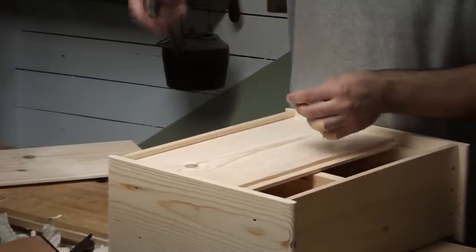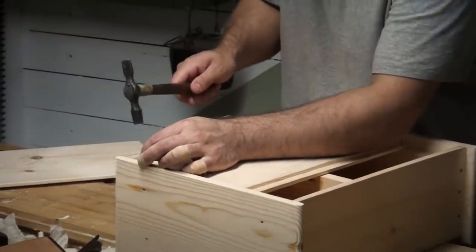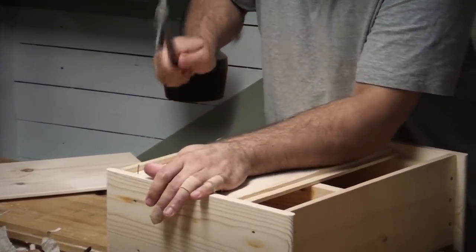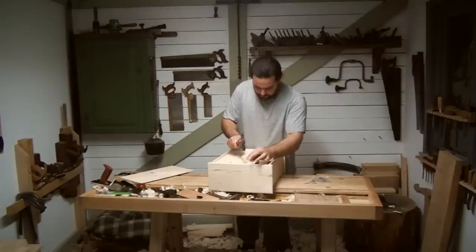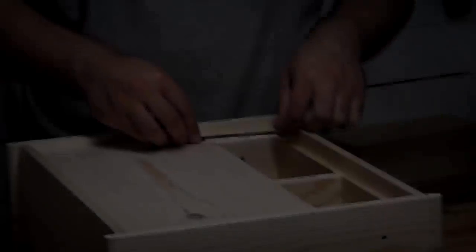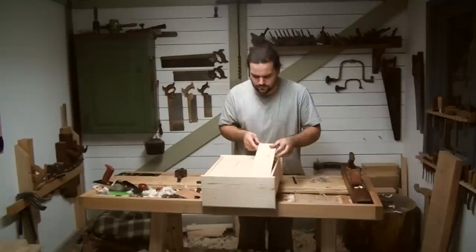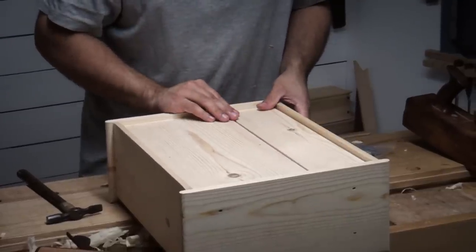There's no fancy way of fixing these — we're just going to nail them. The first piece goes in with the rebate visible, so we can get our measurement from that wall to the side of the cupboard to cut the other piece. Notice how I'm leaving a gap down the side for expansion. With the first board nailed down, I can take a measurement for the second board's width, again allowing for that expansion gap.